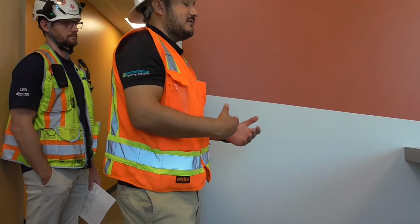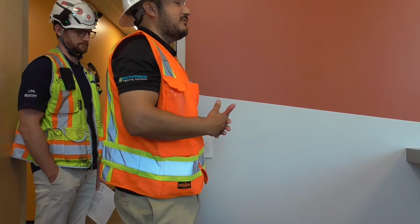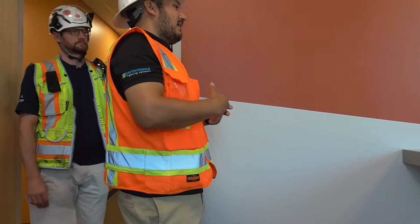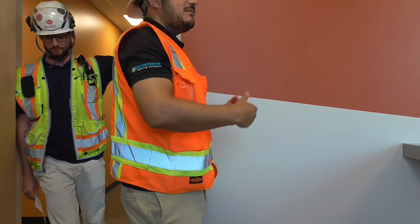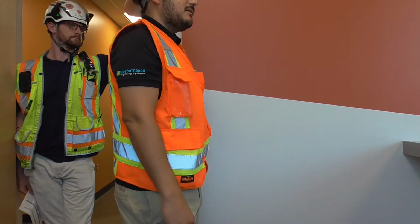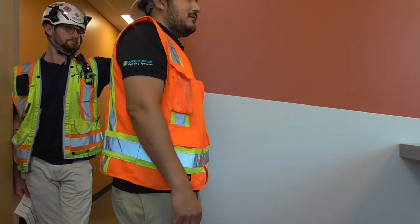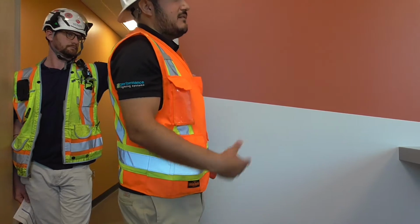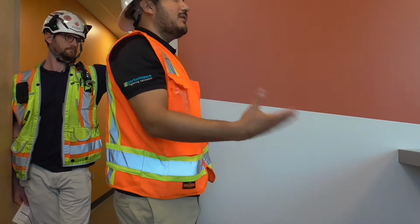Title 24 is the California Efficiency Code for energy saving. They are not allowed to come on to 100. No, you can't. Just the button press, you walk in, it goes to 65%. Can you program the switch so pressing on goes to 100%? No, like I said, that wouldn't be Title 24.